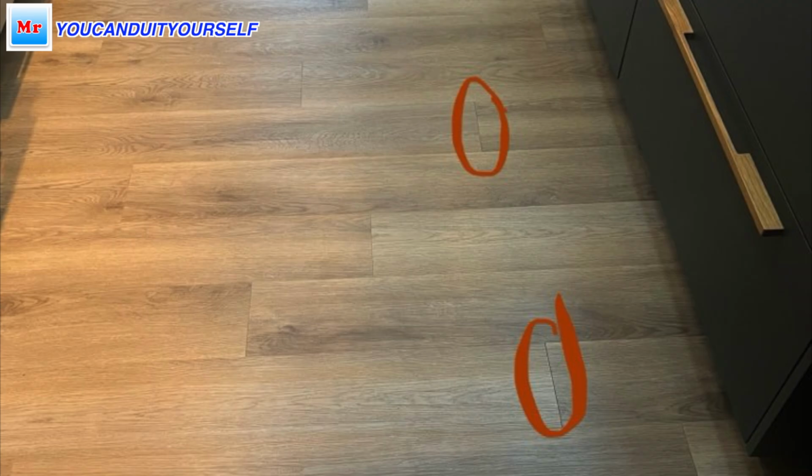I just showed the hallway, but the whole floor is approximately 700 square feet. You know, this big living and dining area, and the kitchen area also. And you see some boards separated in between the kitchen and island. Kitchen from the left side, island from the right side. Why did this board separate? Because the island was installed after the vinyl was finished, and the kitchen cabinet installer didn't make any holes in the vinyl and just mounted the cabinet, the island, over the vinyl, and the island is so heavy, that's why it doesn't give the vinyl flooring a possibility to move.